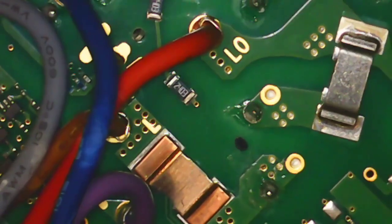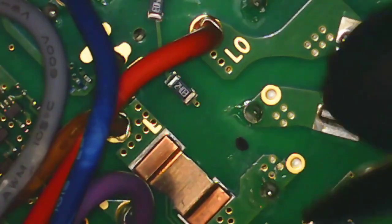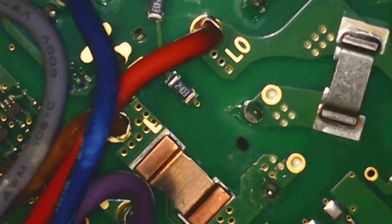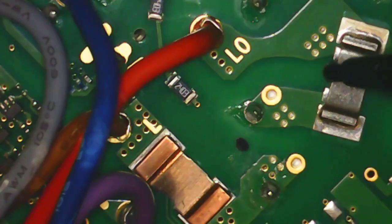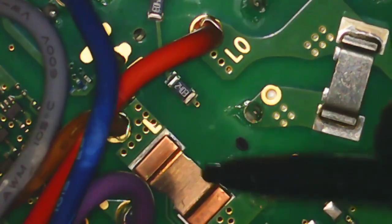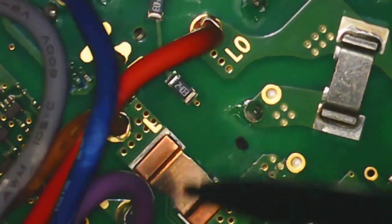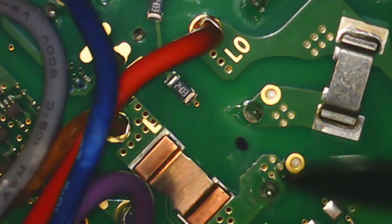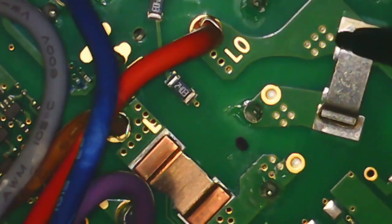Right, so what you can see here, this is just below the relay. So this is the two contacts within the relay. This one and this one. And that's obviously driven by a low power current, which is over there. Or should I say switched, if that's the right term. So what we can see here, we have live in. This is a fuse as well. Comes in to that contact of the relay. Then we have that contact of the relay there. Goes through a second fuse.